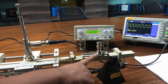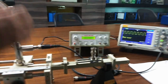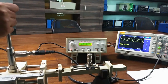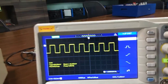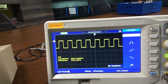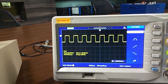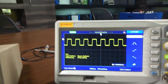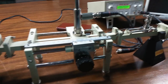This is the maximum penetration position. We can see that this is the waveform and the amplitude or the power of the signal is around 100. To measure the high VSWR you need to set it around 100 or more than 100. With the help of this slotted line, we need to get the minimum value in the SWR meter.